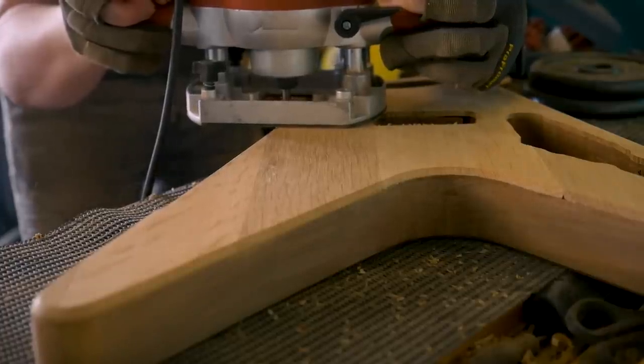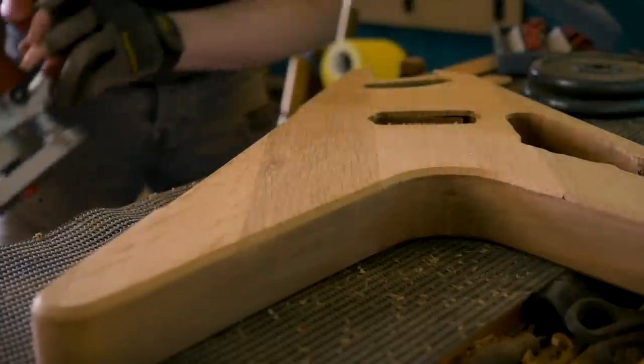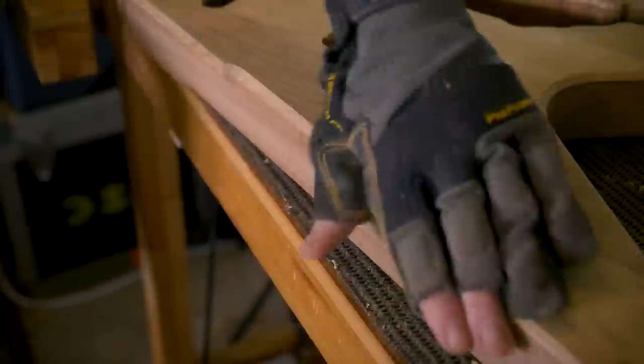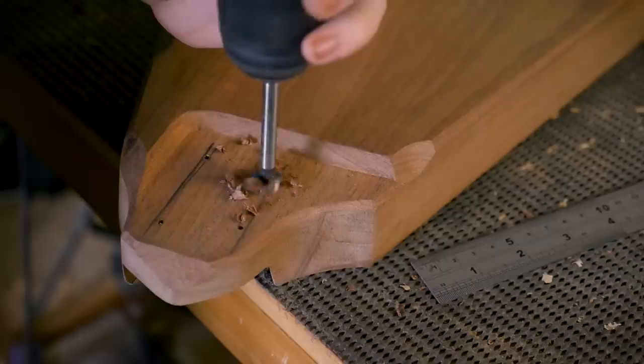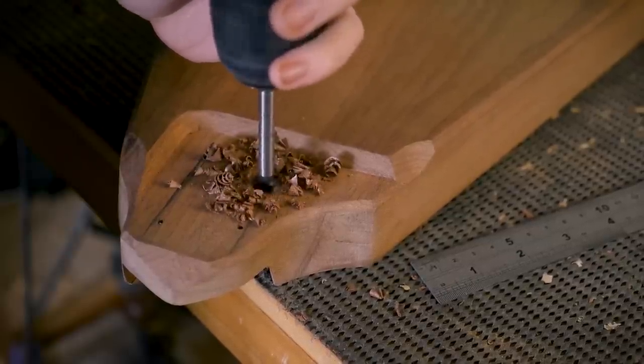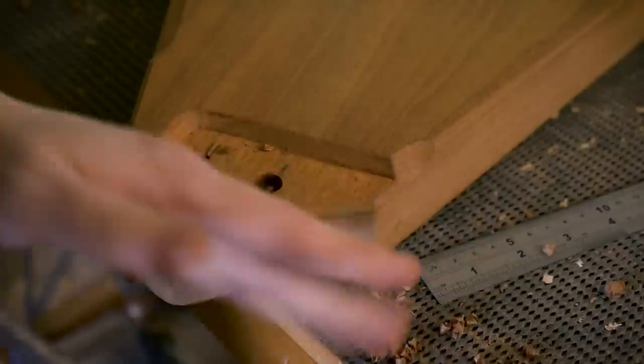I'm mixing modern and traditional design elements with this build. The silhouette is largely classic Flying V, but with modern, minimalist comfort carves achieved using an angled router bit. The neck heel carve is a very grand example of this, which will no doubt divide opinion, but it achieves its purpose of easy, unrestricted fret access and does so in a visually striking way.